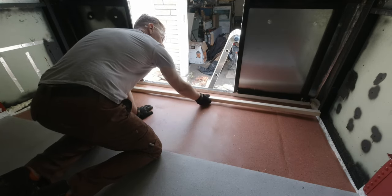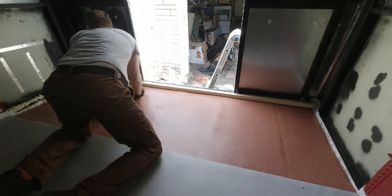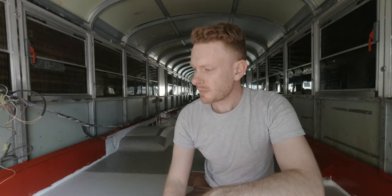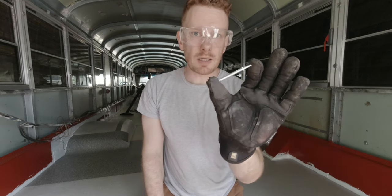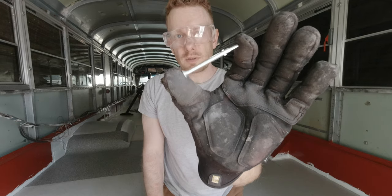I don't want to work on the level as it is right now. I just wanna make sure that it's the simplest way, in the future video, to make the subfloor on top of that without having to cut. So in order to attach the 2x2 that I've already cut and placed, I will use these kind of screws. It's wood to metal self-tapping screws.